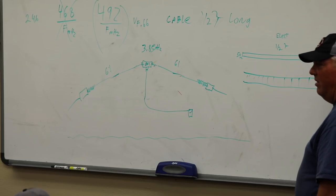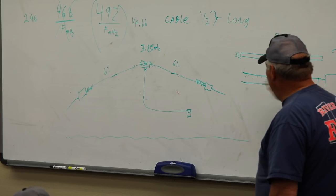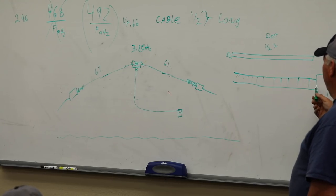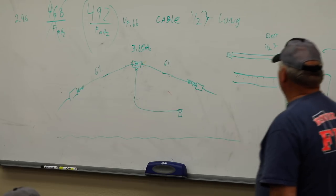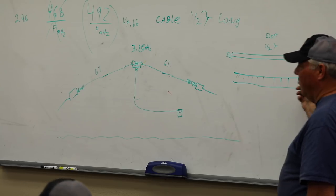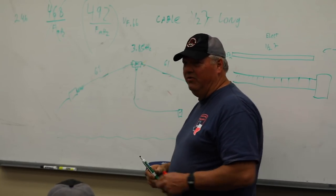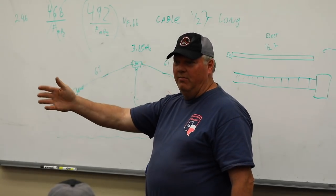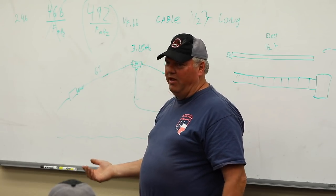And you got yourself a pretty cool antenna with very low loss between here and there. And by the way, we won't go into this in gory detail, but now when I move off frequency, my loss, this handles the loss even better than the coax. We use coax because it's convenient. We use coax because we can run it through the tree, over the hills, and through grandmother's backyard, into my window, and it works. Can't do that with ladder line.